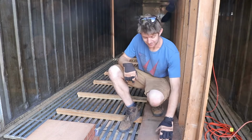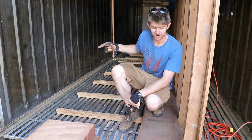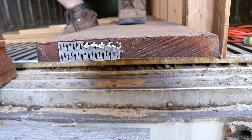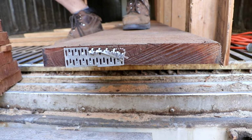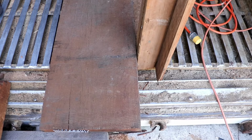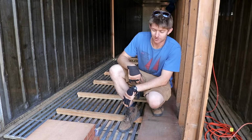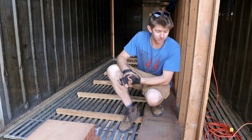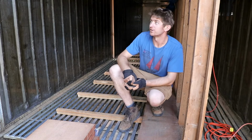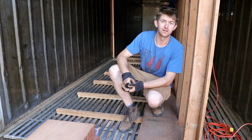So this is the timber that's in the kiln, and the container that it came in was theoretically the same size as this container, but minus the insulation, and so unfortunately the ends of the planks stick out, they don't fit into the container, which left us, I thought, with two options, neither of which are very good: chopping the ends off all of the boards, which would be a horrible thing to do, or just not kiln drying them, until Finn came up with the good idea of building a little box around the end of the container. So I think we're going to try and load them in and build a little insulated end to extend this kiln.